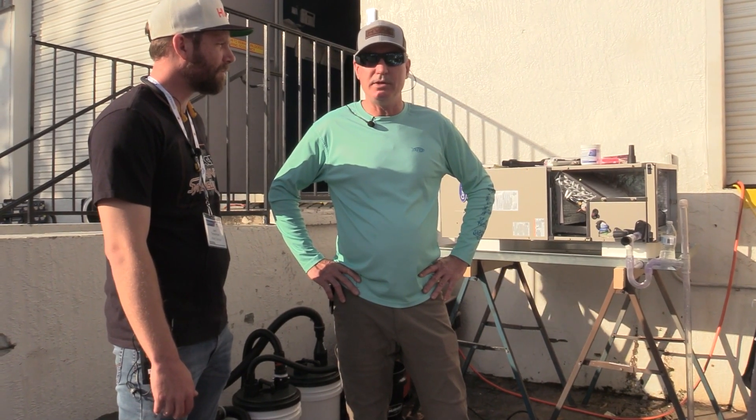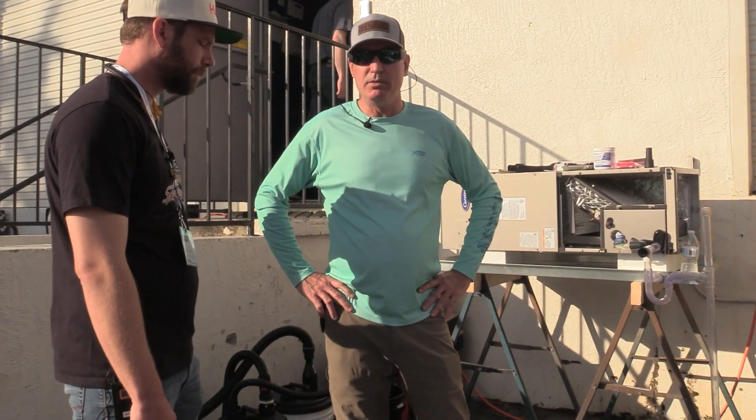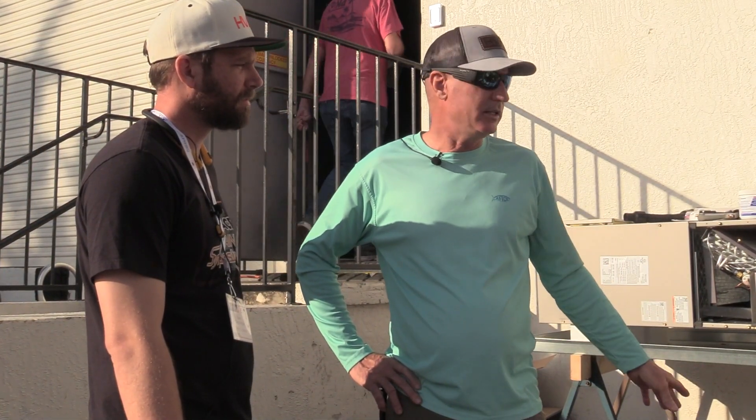This has been out for a little while. We were here last year and did a video. But over the summer, we were running into problems in my HVAC company with running out of nitrogen. My guys are using nitrogen to clean out drains. There's a nitrogen shortage, so we got into the shop vac method and dissected the system a little bit and found a better way to use a shop vac.